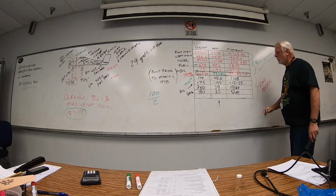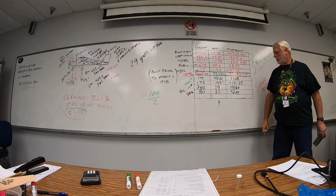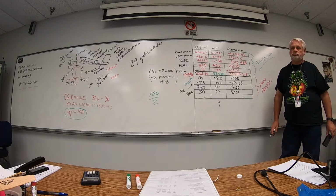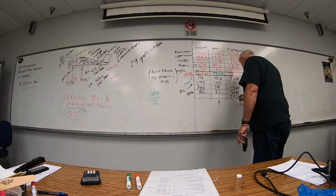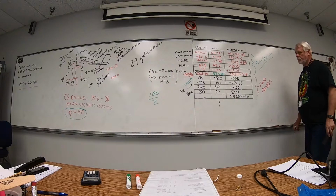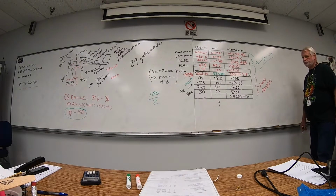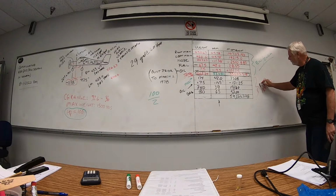All right, let's do some more math. We're going to take our empty weight that we calculated earlier. We're going to add these numbers in. So your moment is 59,260.268. Okay? And the total weight is 1604.84.